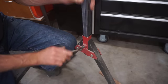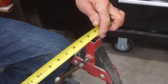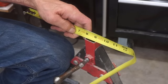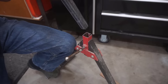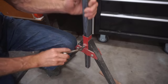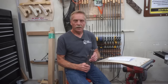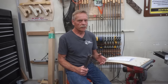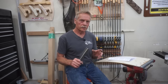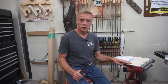The most common workaround for the problem is to use an outer tube with a thinner wall thickness so that the resulting inside size measuring from the weld is a bit over one inch by one and a sixteenth inches. These dimensions allow the pieces to sleeve, but it's a sloppy fit. You can see that's what I did on my original version 1.0 outfeed roller stands and you can see the wobble in the height adjustment here. I've been working on this dilemma for a few months trying to come up with a practical way to remove that stubborn internal weld for a better sleeving fit for the upcoming version 2.0 roller stand build video series.